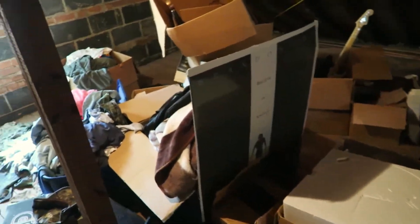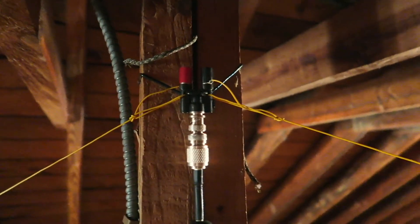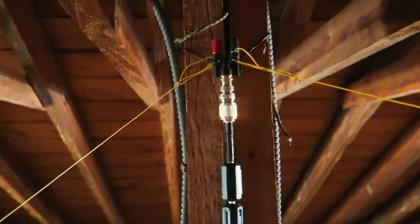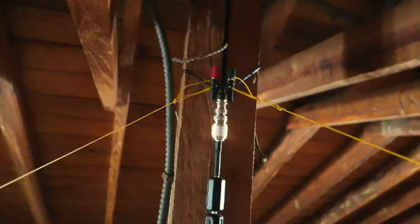A lot of this belongs to my kids who have left home and decided to leave some of their stuff here. I'm figuring with a 40 meter dipole I'm going to run the leg to that corner and over there, and probably run a zag this way, and do the same on the opposite side. This post is almost in the middle of the attic but I don't think it's quite in the middle, so we'll see what I can do.